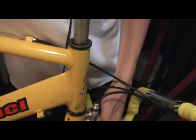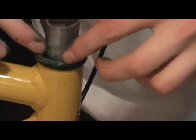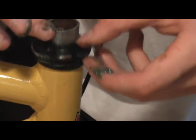Now we'll move on to the top bearings. Just remove these completely. Take some more grease — don't be afraid to use too much. Smear it into the cavity, basically just smear it everywhere. Put some on the bearings, and these just go right back into this little housing here. Then this cap goes back on top of that.